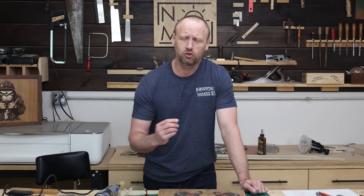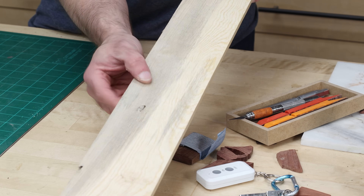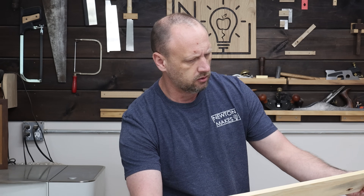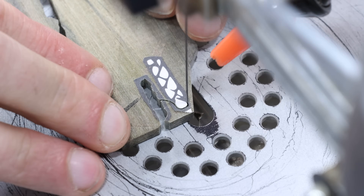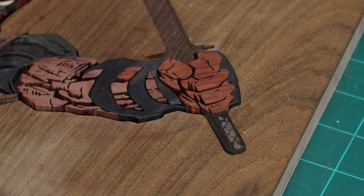The swords are a tough one because they're silver, and silver is the hardest color for me to pull off. To have a fighting chance, I'm going to need the help of some bugs — pine that has had beetles living in it, which discolored the wood. Now it has streaks of grays and greens, maybe purplish. It's the best I can come up with for silver: the pine's already a light color, add the grays side by side and it gives the illusion of silver. The handles are pretty straightforward — I'll use ebony and some of the green parts of blue mahoe, cut out some areas, stick the green in there to look like rope wrapped around the handle, then take my pine, cut some parallel lines, and drop them into place.